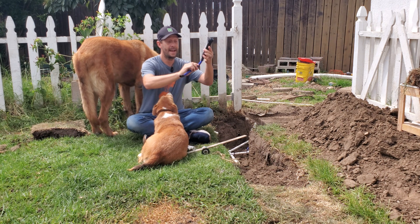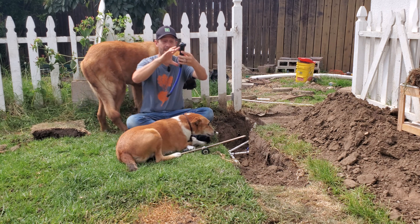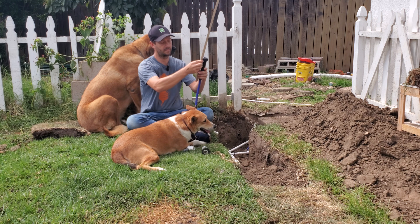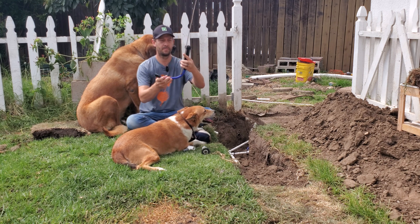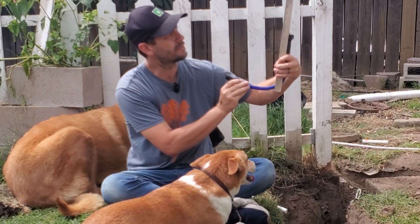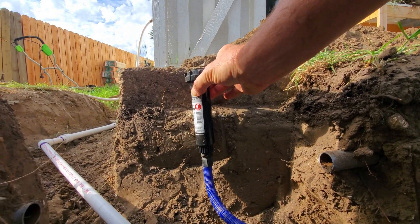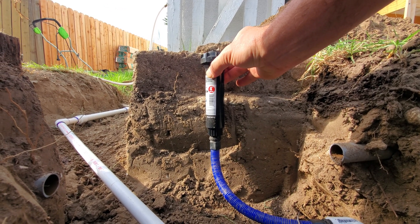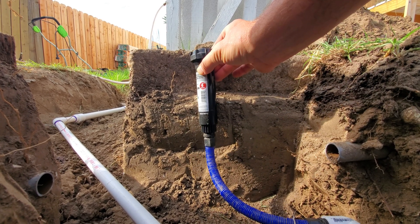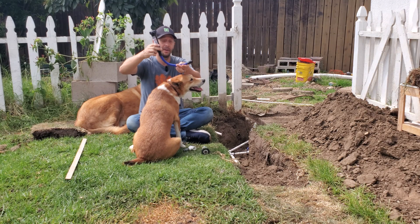With that 4-inch head underground and if you're using a flex pipe, you can't just kink it right there — you need some space underneath. So that right there is bordering on 9 to 10.5 inches. Here in my trench, I've actually got the pipe about 11 inches down, because I'm using the tall sprinkler with a flex pipe that needs a rounded radius at the bottom.